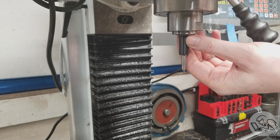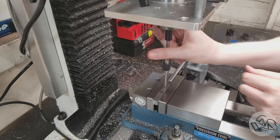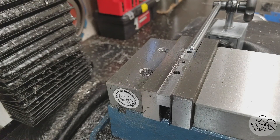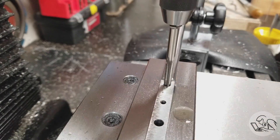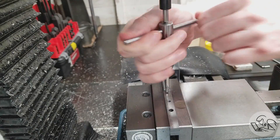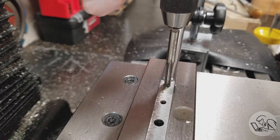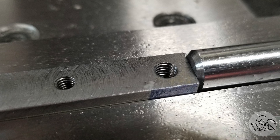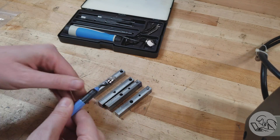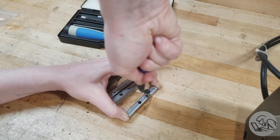The clearance drill for the thumbscrews is a 12-28 — it would happen to be the perfect size for the jaws I could make from the material I had. Quarter-20 was going to be too big and number 10 too small, so a little bit of an unusual size. I'm clearance drilling for 12-28 at one end and drilling to tapping size at the other. The two top jaws also have a little 8-32 blind hole for the bolt that holds the clip in place. With all holes drilled, I switch to my spring-loaded tap follower and do a whole bunch of tapping — 8-32 in the middle for the mounting bolt, then the 12-28 tap, which I had to special order. I went with 12-28 instead of the more common 12-24 because a finer-pitched thread gives you more leverage for clamping. With all holes tapped, drilled, and clearanced, I deburred everything with the Noga tool.